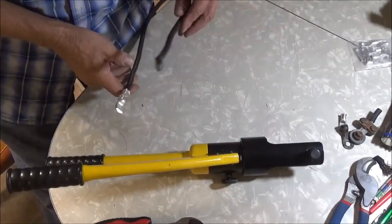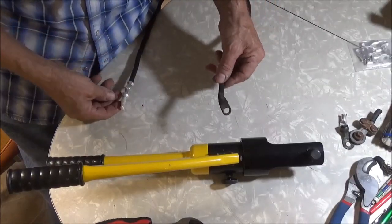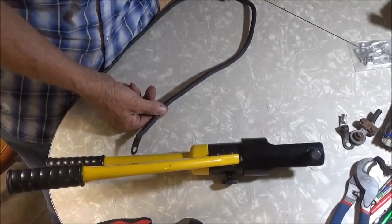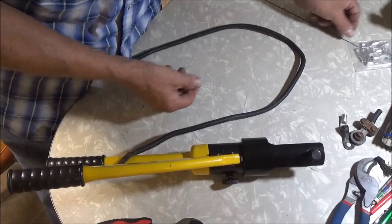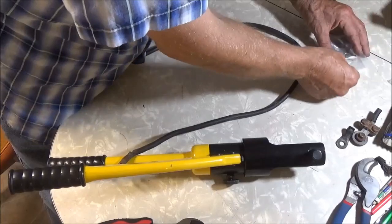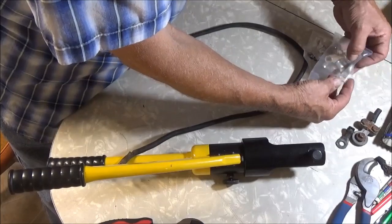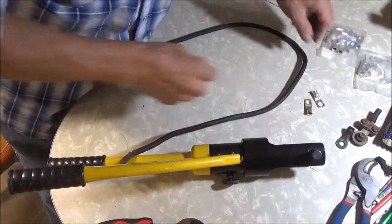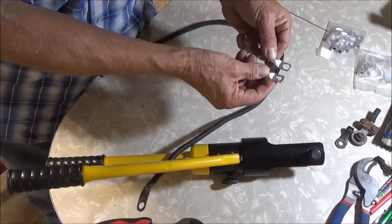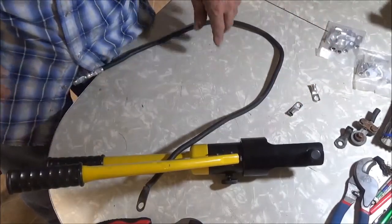Telephone interruption there. I'm going to go ahead and crimp the other one of these on this end. I'm going to cut this off and crimp this on there. Cut this thing in half, and then I'm going to put one each of these, a big one and a little one. Three-eighths and a five-sixteenths. I'll use the same color wire, but they'll only go on the holes one way, because this one's 3/8 and this one's 5/16. Won't be able to get them both on there if you put them on wrong.